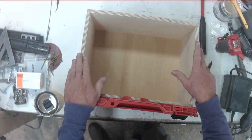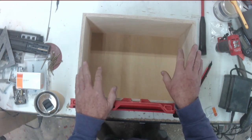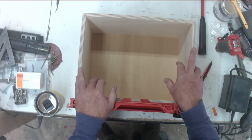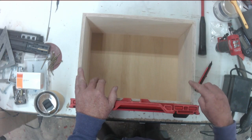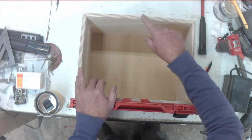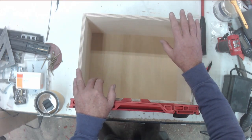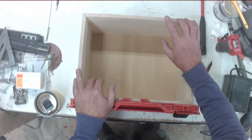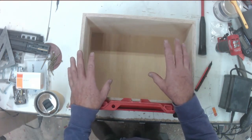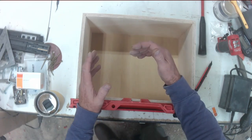and it's made out of a half inch Baltic birch plywood, which is a very high quality plywood, but one of the things that makes it high quality is that it's very dense, meaning that it doesn't really have any voids in it. If you look at the cut edge here of the plywood, normal sheets of plywood have occasional voids in them. And this has almost none. And so it's very, very solid, very strong material. And the nice thing about not having many voids in it is that you're not going to have a void in some place where it's going to affect your design.